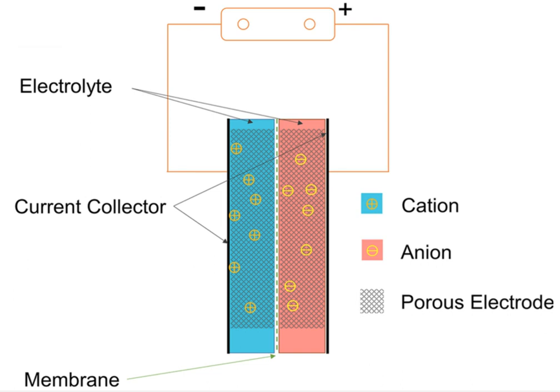Current load and cycle frequency generate internal heat, so that the evaporation-determining temperature is the sum of ambient and internal heat. This temperature is measurable as core temperature in the center of a capacitor body. The higher the core temperature, the faster the evaporation and the shorter the lifetime. Evaporation generally results in decreasing capacitance and increasing internal resistance.